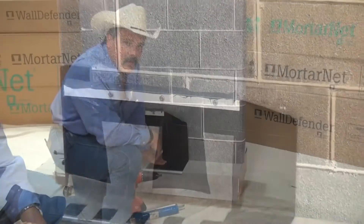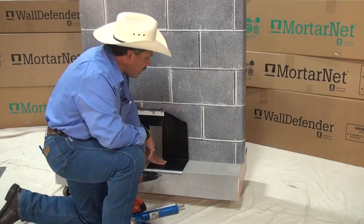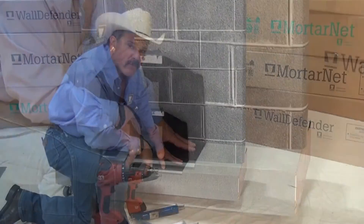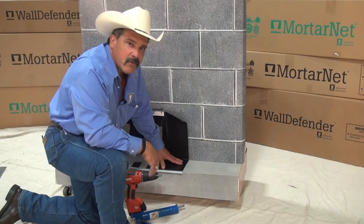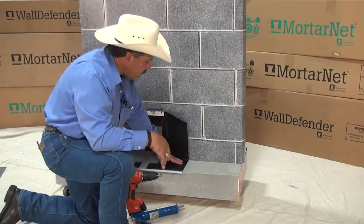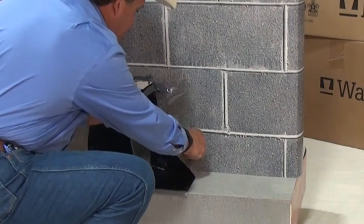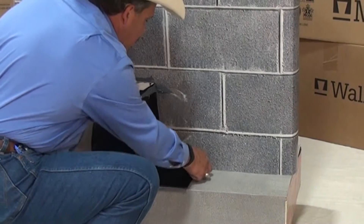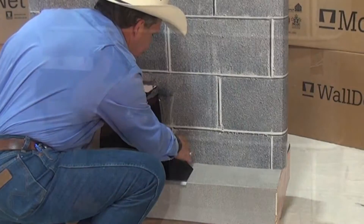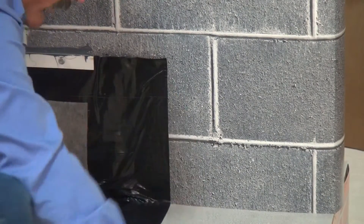And that's the whole point of it. We're at the other side of our lap now, getting ready to do the lap. We get a lot of questions: with rubberized asphalt, does this part need to be adhered down to the substrate? For the time it takes to pull the release paper, it's not worth not doing. So we're only going to show you how to do it. Just grab it, take your release paper, and tuck it up underneath. Make sure you have a good seam. Then you go ahead and get ready for your next turn bar.